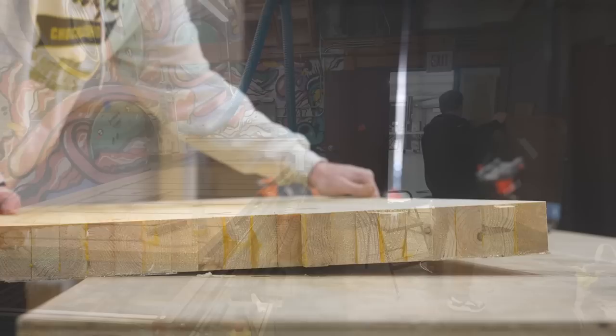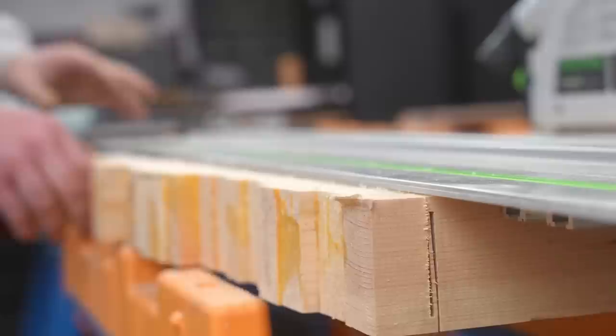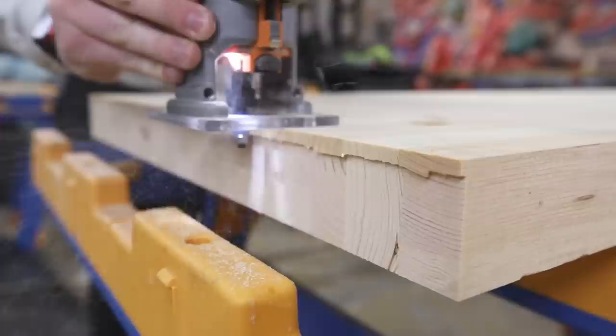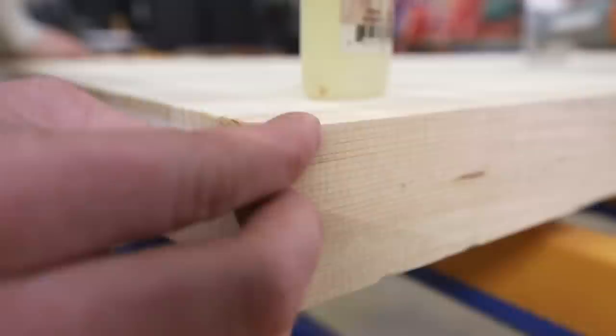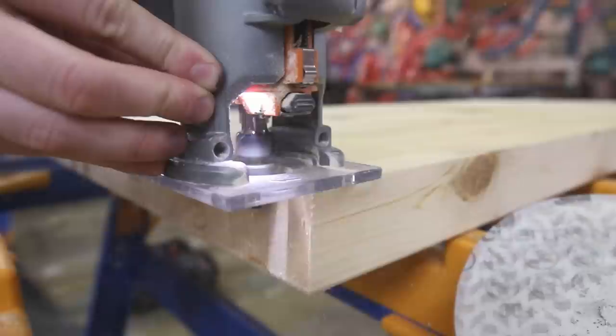For the amateur build, we took the glue-up into the garage and used a track saw to cut the edges square. Because the top was thicker than the cutting depth of the track saw, Cam had to do two passes — a bit of a learning experience. He then ran a trim router over the edge to get everything flush, but forgot to prep tape around the corners to prevent blowout, so he ended up with some tearout. Fortunately he kept the piece, so we used a little CA glue to put it back in, and hitting it with a roundover bit should make it practically unnoticeable. Crisis averted.